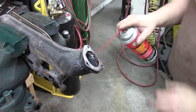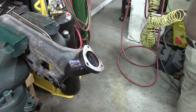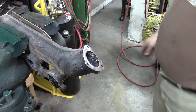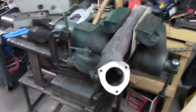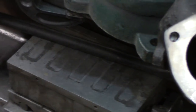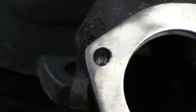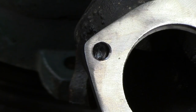Now sometimes during the process it'll pop a chip in there — just a little air to make sure it's out. Guide out, done, clear. Grab a little cleaner, blow it out, get rid of that oil. I'll show you guys the hole over here so you can see how good of a hole it made, threading wise. We got a real good hole — threads are good all the way around. It found its own center. Now obviously this is bigger than 3/8-16, which is a helicoil.